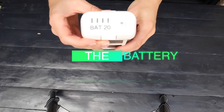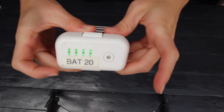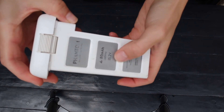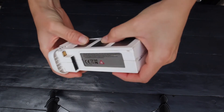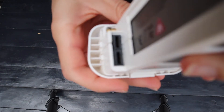Let's move over to the battery. Firstly, check the battery level without powering on the battery itself. Now inspect the overall condition for any cracks or damage, and most importantly ensure there is no visible swelling of the battery pack. Inspect the contacts for any signs of melting or lodged objects.